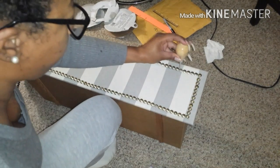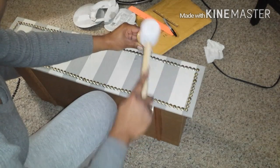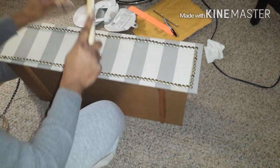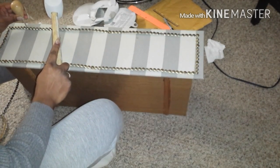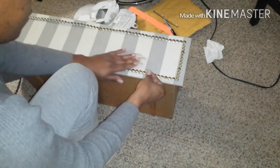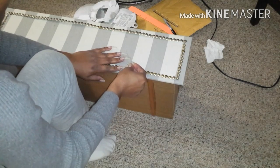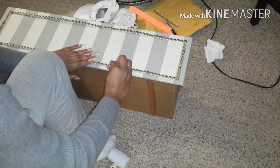I've applied very few nail heads up until this point; now I'm going ahead and making all the holes that still need to be hammered in. You don't need to go all the way through with the awl — just enough so you can put your nail head into the hole and then hammer it in with your rubber mallet. When laying the trim down, applying nails to only the first, middle, and last sections of your nail head trim works a lot faster than applying each nail per hole. After this I'm going to apply the new drawer pulls, and you'll see the finished product.